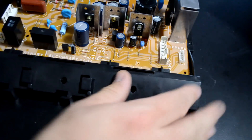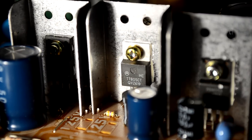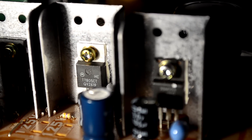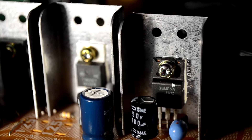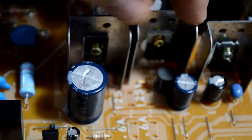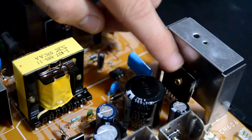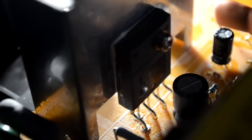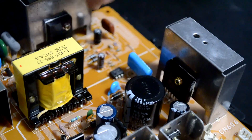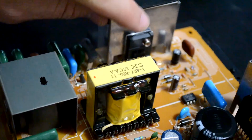Let me slip this board around so you can see some other parts that could fail and cause troubles. If you notice these IC chips right here on these big heat sinks, sometimes those can burn out and you may need to replace one. This board has three different ones, all with different part numbers, so you need to look at the front of the part to get the part number and desolder it. If your power supply isn't delivering power to your monitor, you can come in here and change out these components. I have another monitor, a 20M2, that has had these chips go bad — they get overloaded with an improper voltage and will pop when they fail. The good news is these are still orderable from eBay, coming from China.